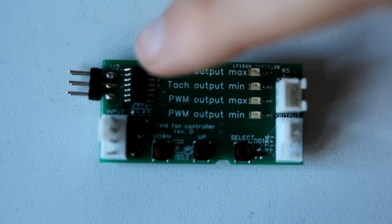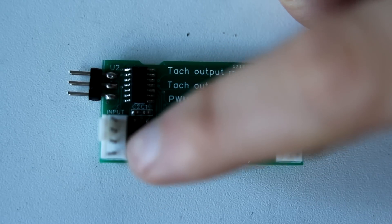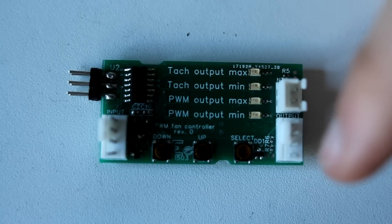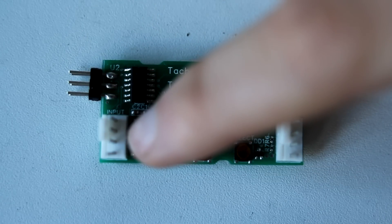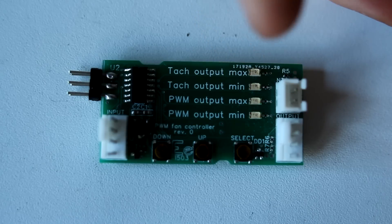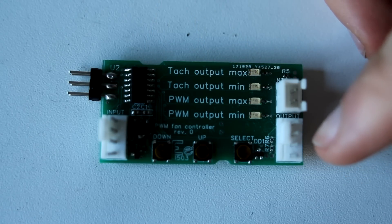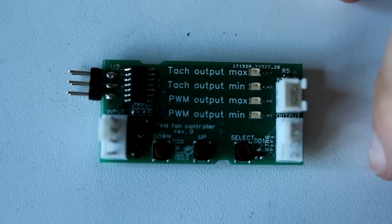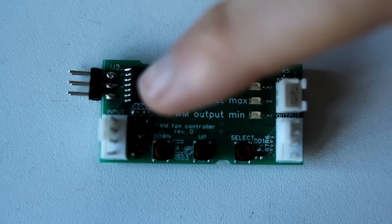What this microcontroller does is it intercepts both the PWM line coming in from the motherboard going out to the fan. The motherboard can send any PWM value, but the microcontroller interferes and changes that value and outputs it to the fan. The microcontroller also intercepts the RPM signal coming back from the fan, modifies it to your liking, and then sends it to the motherboard. For instance, your motherboard can output 50% PWM, but if the microcontroller is set to constrain the maximum PWM to 20%, then it will never output more than 20% PWM. This is essentially the use case: either limit the speed of attached fans, or increase or decrease the minimum or maximum RPM signal your fan sends back to cope with motherboards that are picky about fans.